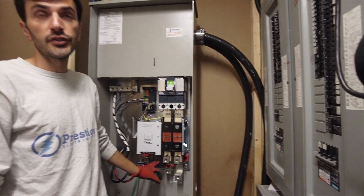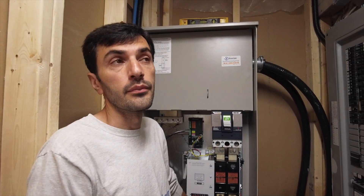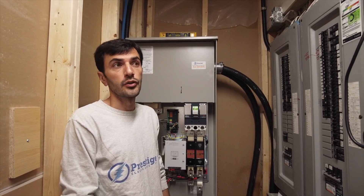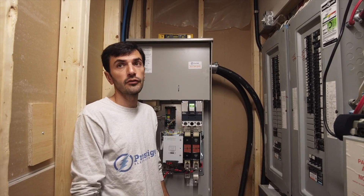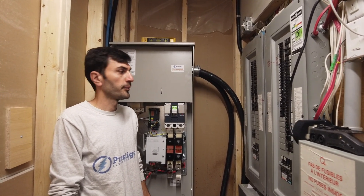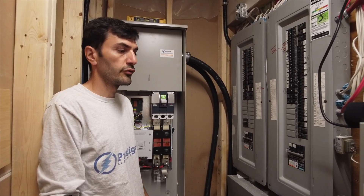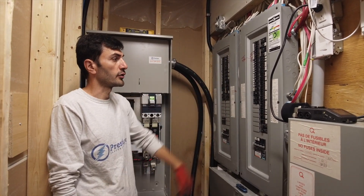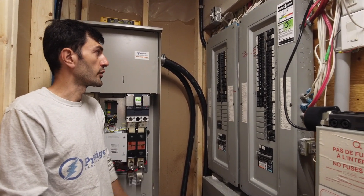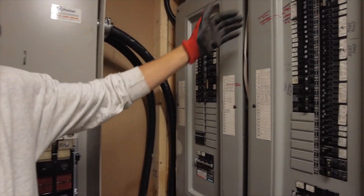The generator is 26 kilowatts, so it's going to give us 110 amp maximum. We don't have enough power for the whole house, so we will put modules on the furnaces. There are two furnaces in the property — one for the second floor and one for the main floor. The second floor furnace is going to be permanently off, but the main floor one is going to be at half-load. They're still going to have heating and cooling, but not in full range, so the rest of the house is functional. The house is huge, so they need power for the rest — mainly lights and outlets.